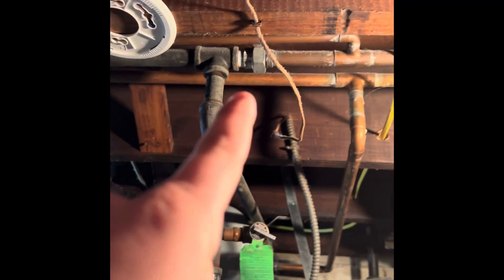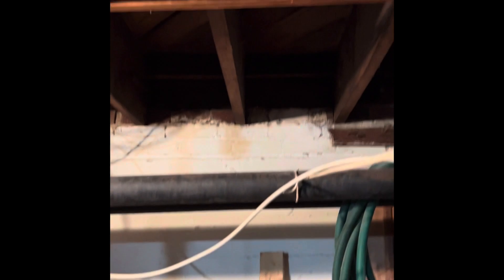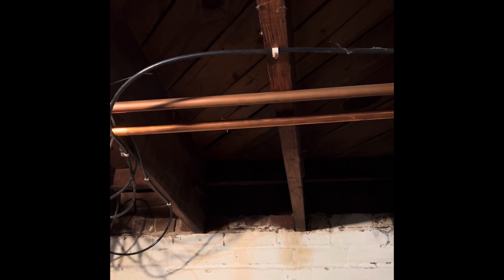We have the floor drain in front for our backflow preventer and the condensate from the boiler itself. Our water line is right here. We'll follow that cold water line back over to this side, tap into it here, and drop back down into the new boiler for our water feed. Then we're going to tie our domestic hot water back into the water lines right there as well for hot and cold water for the space.